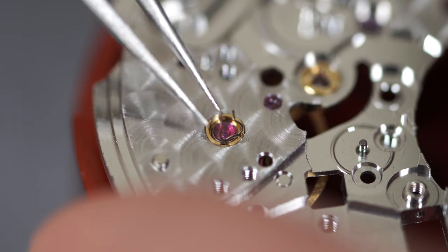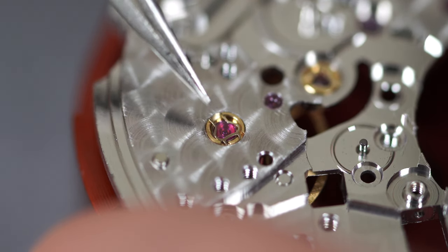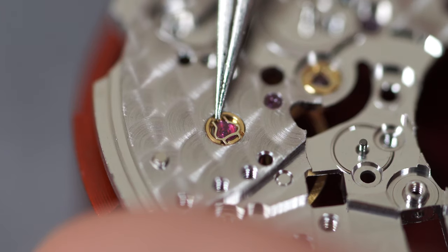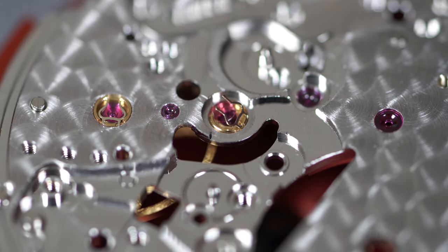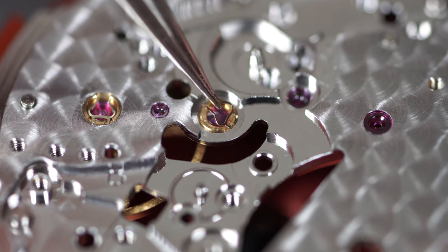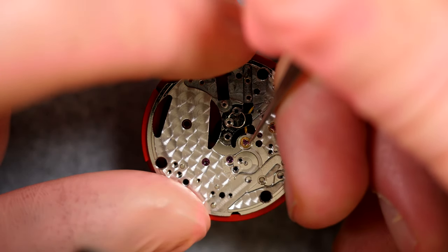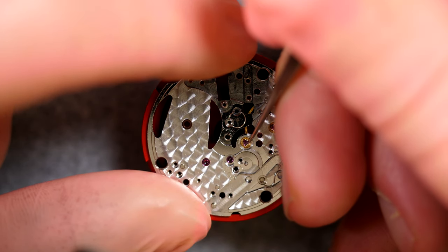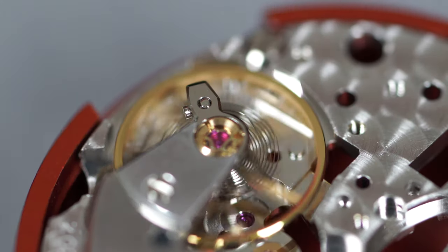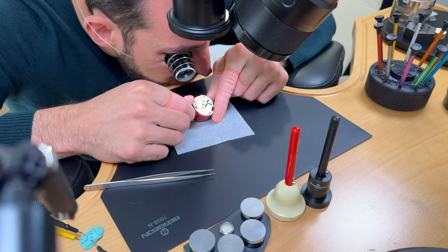Closing the spring — it's always tricky to close, especially under the camera. Placing the capsules for the escape wheel in position and closing the spring. Checking with a hair that the balance is turning freely — it looks good. Checking the hairspring — looks fully concentric, no bend, fully flat. Looks good on this watch.